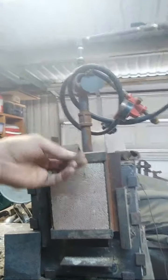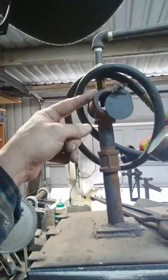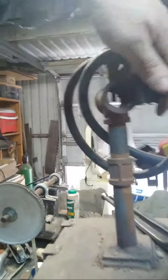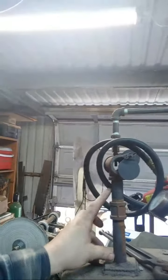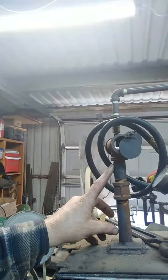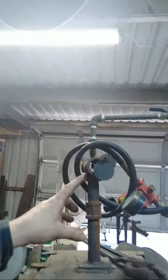Okay, this is my Frosty T burner forge. There's the burner. I've added these little air control flaps, which you don't really have to do. You can tune the burner with the length of your jet that you see right there inside. The length of your burner tube is important. If it's too short, it's not going to work. There's a formula for it. I don't know offhand, but this is a 3/4 pipe right here, and that's about 10 inches long, somewhere in there. There's literature on the Frosty T burners. So as long as your burner's good to go.